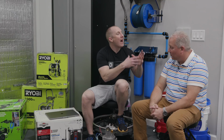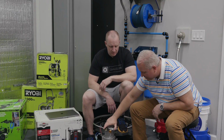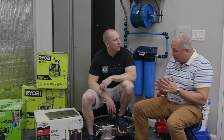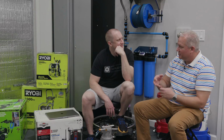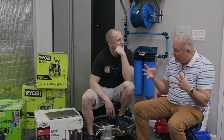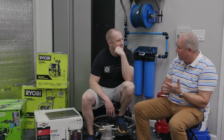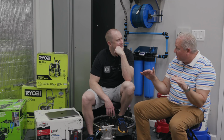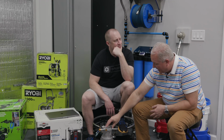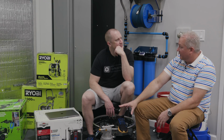I know there has to be a standard. Sure. And so why is it that way? Yeah, it's a good question. So basically to have a baseline, right? You said it exactly right. If I change the hose or I change the trigger handle, the different accessories can change the pressure or the flow of the unit. So to keep things consistent, they're always testing it right here at the head, and that's where your rating is coming from.